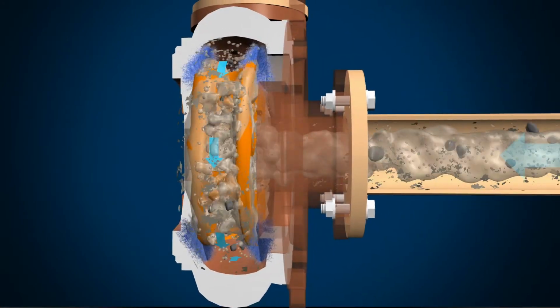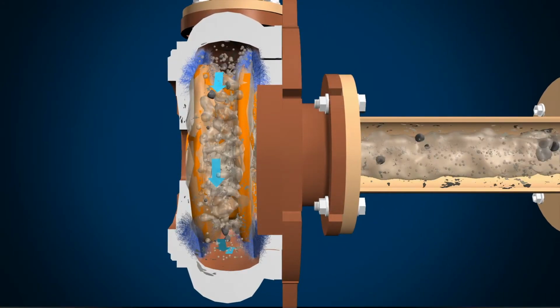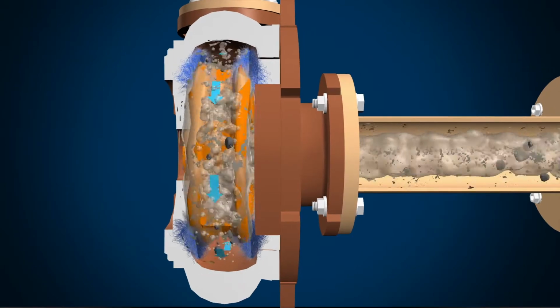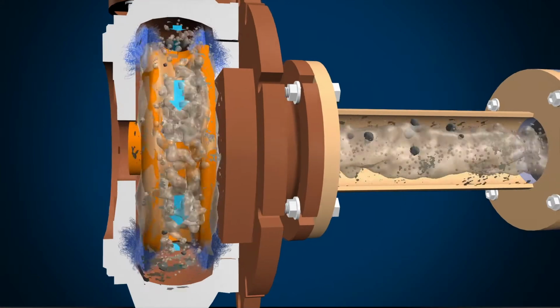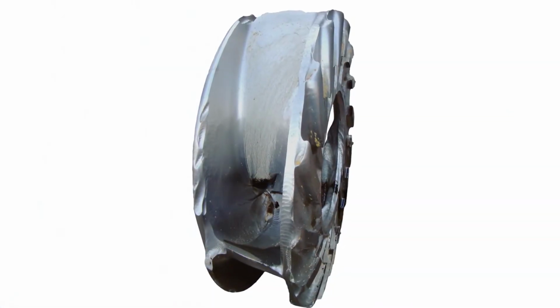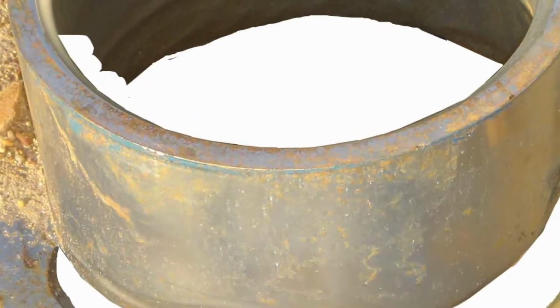So when you have an old style pump design, where one does not look at these interactions and just takes an existing pump design and adapts it, you may wind up, or more likely will wind up, with a product where the fluid has sudden accelerations and sudden decelerations within the volute, the casing, and the impeller passages, and therefore it creates a lot of turbulence wear, and consequently the pumps are very inefficient.